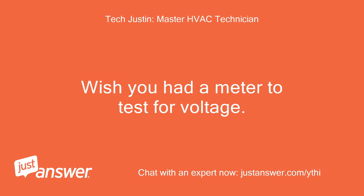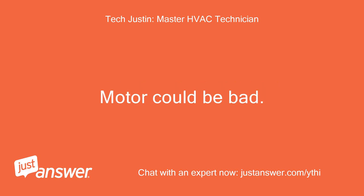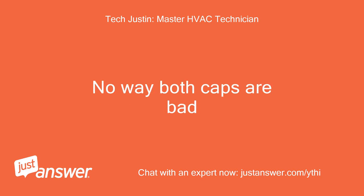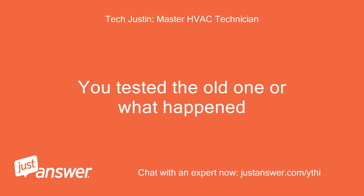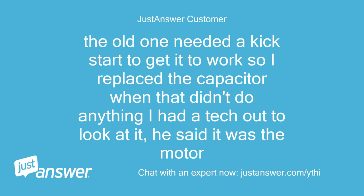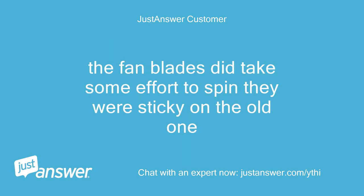Wish you had a meter to test for voltage. Motor could be bad. No way, both caps are bad. How did you arrive at the original motor being bad? You tested the old one or what happened? The old one needed a kickstart to get it to work, so I replaced the capacitor. When that didn't do anything, I had a tech out to look at it. He said it was the motor. The fan blades did take some effort to spin, they were sticky on the old one.